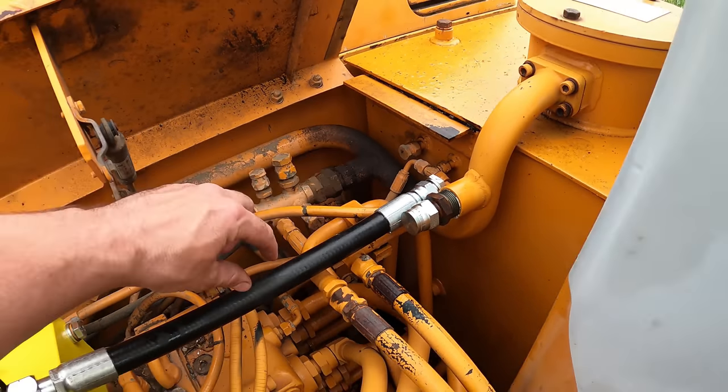And in order to do that, the only way I see, first of all, I got a number 12 O-ring boss to go into that block, and then I got an extension, and on the other end this is NPT tapered pipe thread. Then I figured that wasn't going to be long enough coming out of there, so I got an extension, which is just a female NPT to a male NPT number 12. So those will just go together, which kind of brings it out a few more inches.